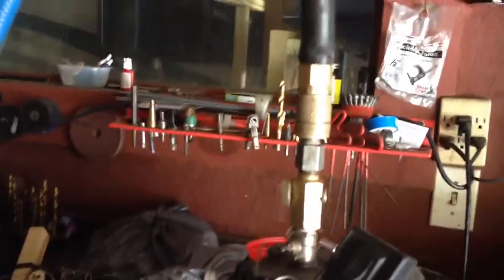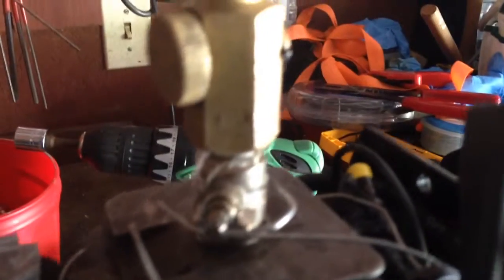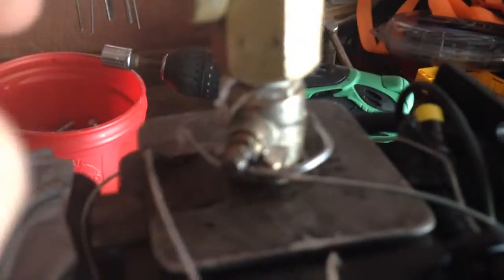This is all made out of stuff I had around the house. This is the valve assembly. Other people on YouTube make it far too complicated. All that's in this lower part right here is an old valve where I just took the handle off and made it go straight. There's about an inch and a half screw in there. Whenever the piston's at top dead center it'll push that screw up and let air in. So it's a homemade check valve really.